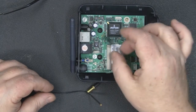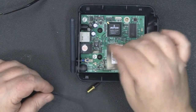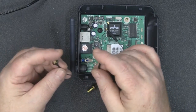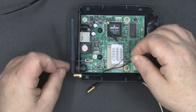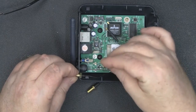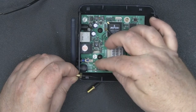Because this has got a U.FL connector for one of those traces, you can simply unplug the little dipole antenna and pop it out. You can get one of these little pigtails already made up with a U.FL connector on the end — I'll put a link in the description — and you could just mount that directly in the hole left after you remove the dipole antenna, click it onto the U.FL connector, and you're connected.